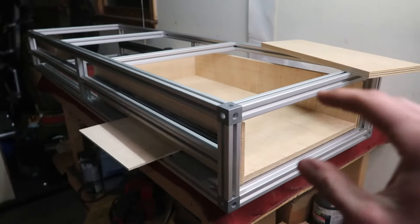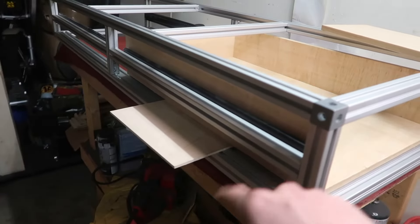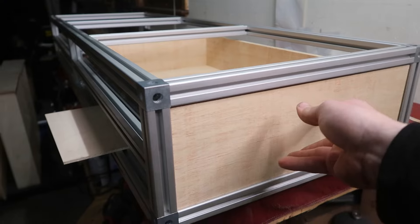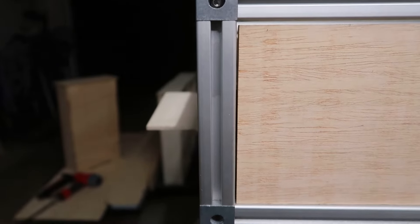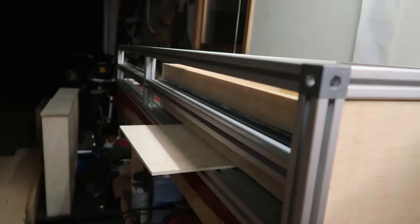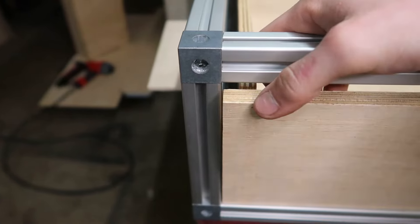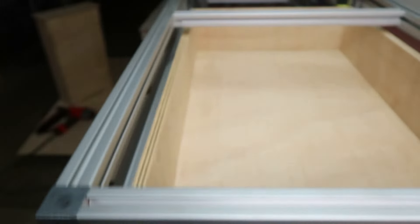Now that we've got our main drawer boxes made, we're going to attach the faces. I've taken a scrap quarter-inch piece of birch and laid it across to space the drawer up a bit so it doesn't rub as it comes in and out. You can place the face where it's going to be, then check your gaps on each side — make sure the gap on each side is even. Don't worry about the up-and-down gap because we can adjust that with our side rails later; let it sit flush on the bottom and make sure the side gaps are even. Then figure out where the drawer lands on the front, make a little mark, and use a finish nailer — just two finish nails on each side — to attach the face to the module.